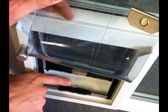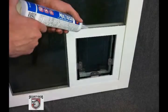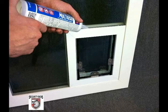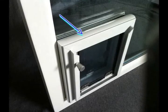Remove the frames from the glass when drilling to guard against glass breakage. Once you have mounted the frames and spacer, you will want to use a silicone sealant around the exterior frame to ensure a tight weather seal.